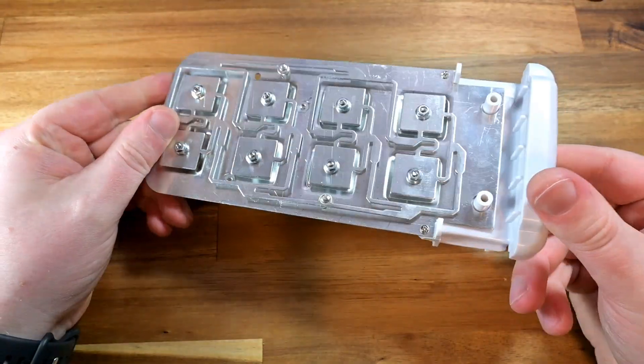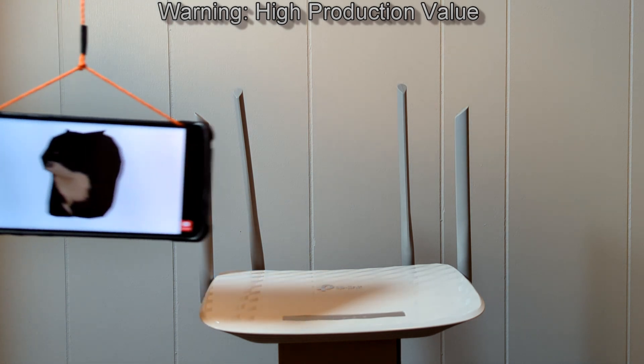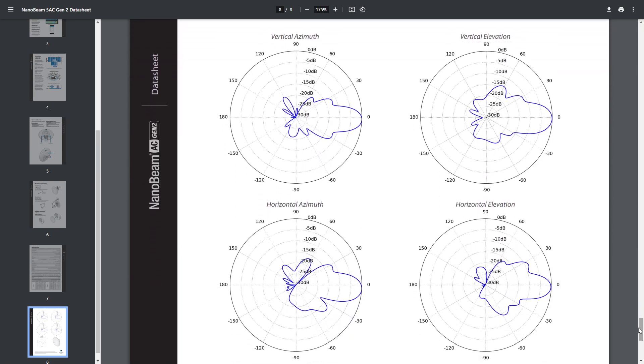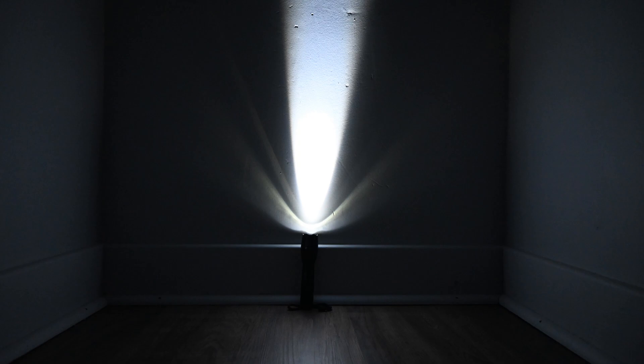The most significant difference is the antenna. Your home router is designed to give you somewhat even coverage all around it, but these PTP bridges will usually focus the same amount of wireless power in a very specific direction. Think about it like comparing a bare light bulb to a flashlight — each could put out the same amount of light, but since the flashlight focuses that light into a narrow beam, it will reach much further but only in the direction it's pointing.